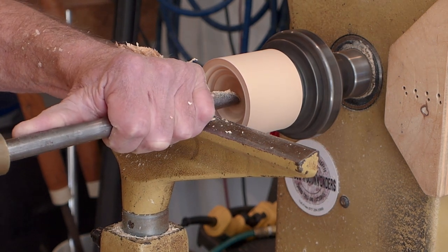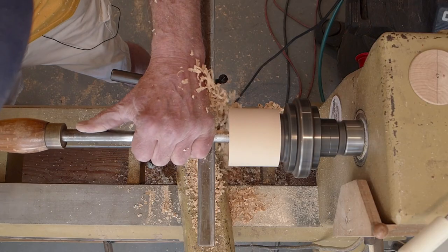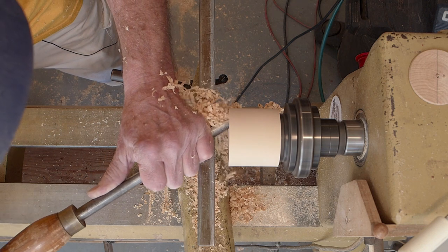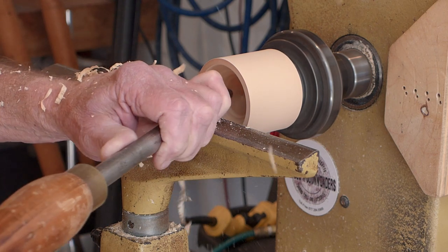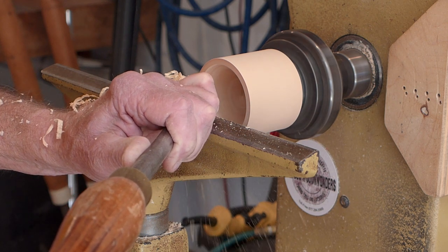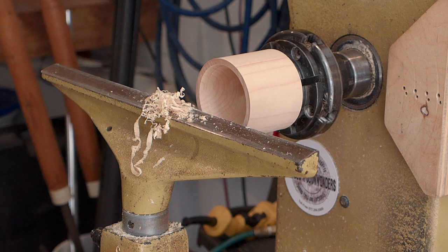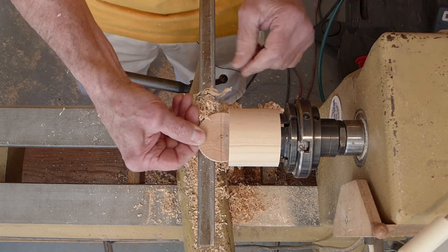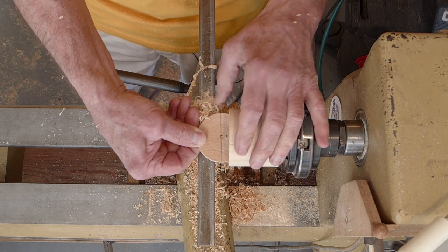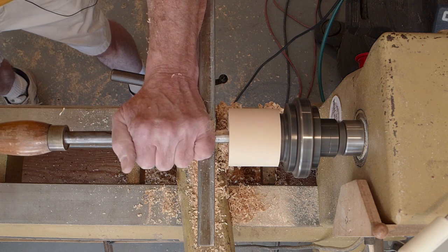And as we get to this point here, we need to start thinking hemispherically. Could be smoother than that. All right, does it look like I'm halfway in? Well, it's not a bad looking radius, and you'll see right here that this line in the center has to go flush with the surface right here, and it's got 5/16 of an inch to go. So we can take a pretty good cut right from the bottom out.